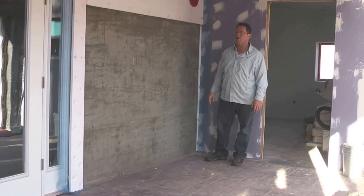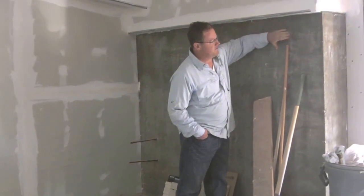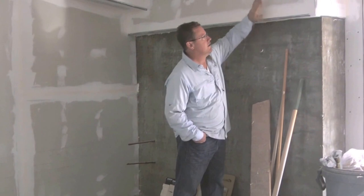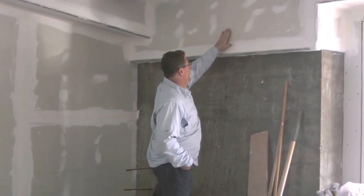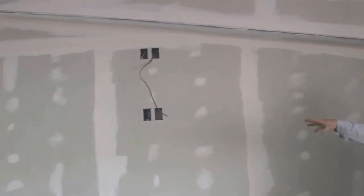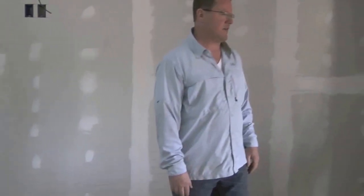Let's take a look at the wall and the ductwork. This should give you an idea of how thick this wall is — 18 inches of concrete and rock. Above this wall we have ductwork hidden in the drywall, running over to this closet where the small propane furnace will be. So we will have the ability to turn on the fan and heat the rest of the house with warm moist air from the greenhouse.